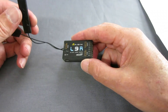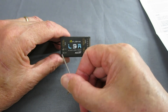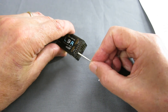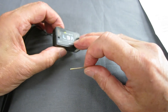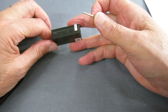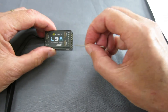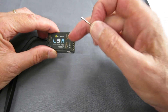Just have to be a bit careful handling them. We have a fail-safe button here and a binding button, with an indicator LED. There are channels 1 through 8 there, channel 9 down here, S-Bus down here, and the RSSI connector there. Negative goes down, so the signal wire is on the top line. On the bottom two, the negative is on the outside, so the signal wire is on the inside — signal wires go up and in.